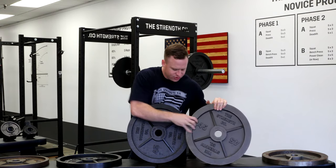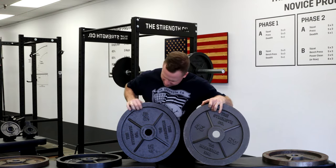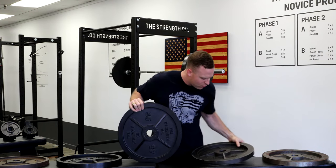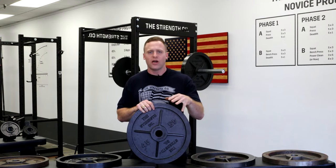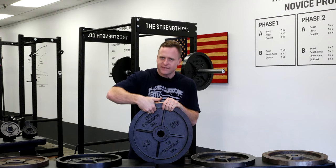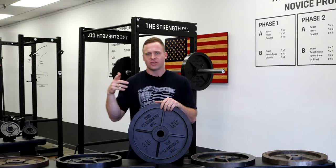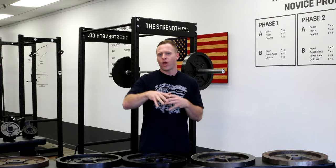You can notice the difference between these two faces — the final version ended up with a shorter lip face height than the original sample, and aesthetically I think it looks a lot better. Now, any changes from the 45 that went into our 100 — which just started shipping in the last few weeks: we wanted the same lip but did open up the center diameter from 1.99 to 2.01 inches. Early orders might have the 1.99, but we opened it up because the plate's so heavy that a little extra clearance makes it easier to maneuver.